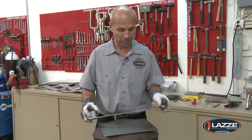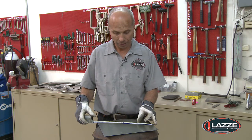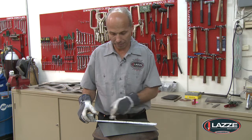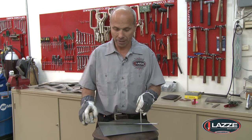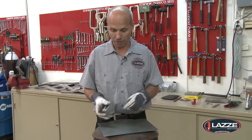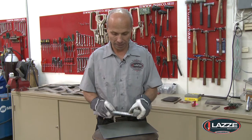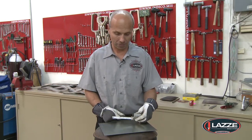The only thing to be aware of is that this little hole is 100 millimeters up. So when using the numbers on the tape measure, you need to add 100 millimeters to get the right radius. The metric version has that hole; the inch version does not. I talked to the company in Sweden — they won't produce the combined inch-and-metric version anymore, but you can purchase both versions at my website.